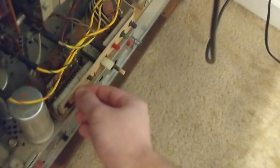So we're going to put the DVD back on. Once the player starts working — it's not plugged in — you can see we have audio now coming through but no picture. What we're going to do is turn all of the screens all the way down. Red, green, and blue — they already are. We're going to turn the bias down because this CRT is practically brand new. We still have this purplish color.